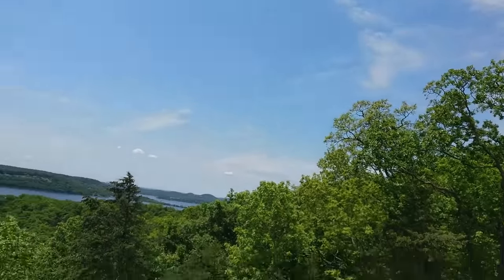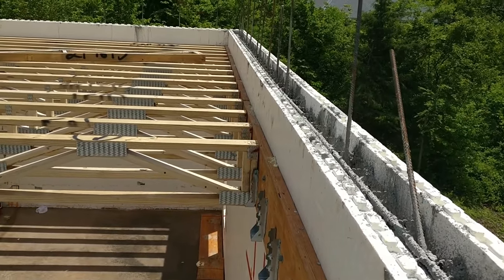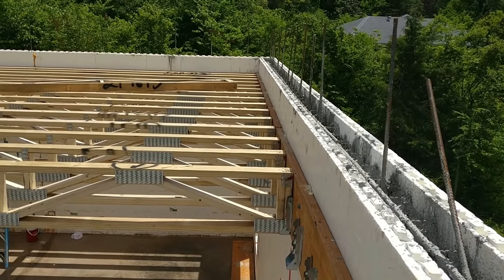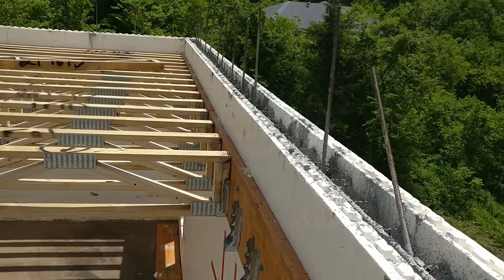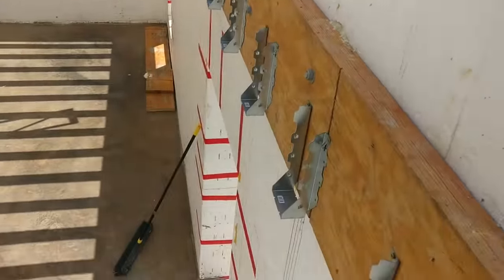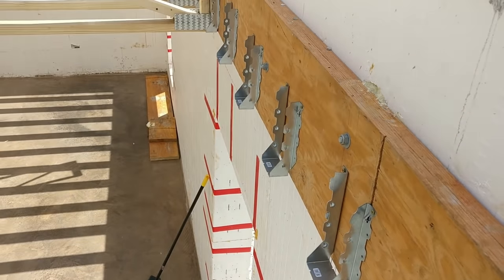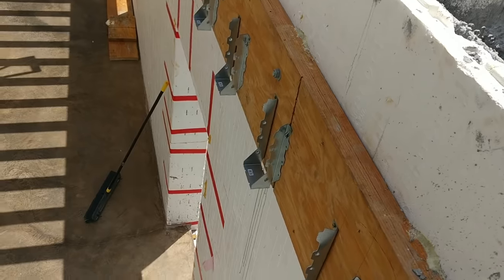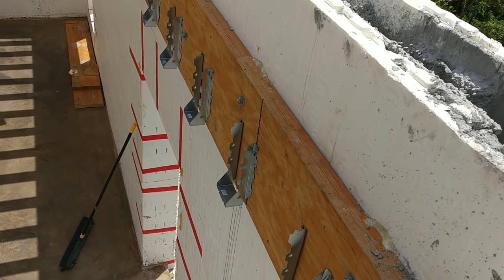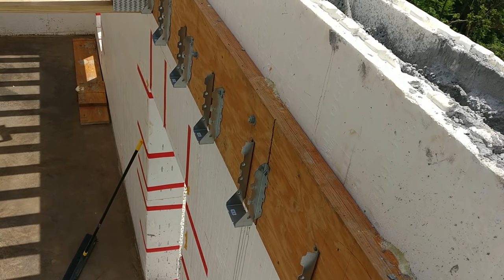Well, the good thing is on our job it looks like they are all dead on. I am looking down here and there is just an ever so slight difference between joist to joist — it is just perfect. And if you'll notice the joist hangers on the bottom, how wide they are — they do that so that it doesn't have to be exactly the measurement. You have to allow a little bit of space for wood to expand and contract, because regardless of how old the wood is or how many times it's been in a kiln to dry, it is going to expand and contract for the rest of time.